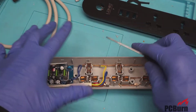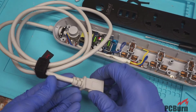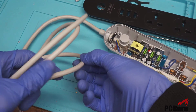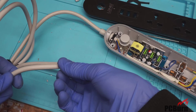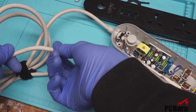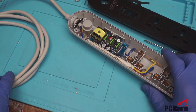It's kind of a mishmash because the plug is approved by the Canadian Standards Association (CSA), and the cable is UL listed, rated for 10 amps — UL SVT VW1, 105 Celsius and 300 volt, and elsewhere it says 200 volt, so the SVT rating may be 200 volt and the VW1 rating 300 volt.